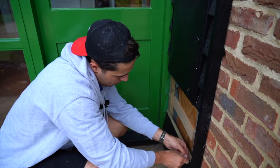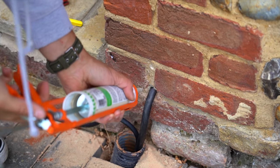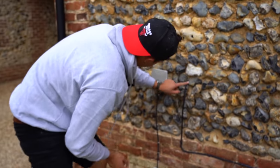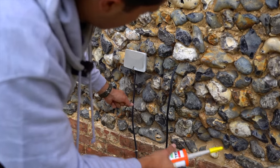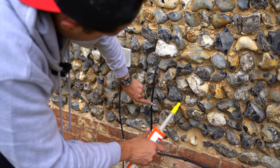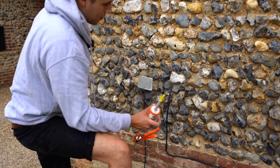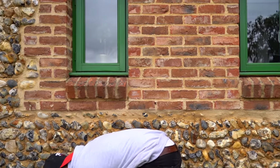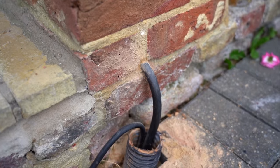I'm just reinstating their house which we've been taking to pieces. Mixing up some mortar, smushing it down into those cracks — a bit more seamless than silicone. I don't think I'm going to put any cleats on this section; they haven't done it there, and I don't really want to permanently mark any of their flint stones. That cable entry is sealed up now — I've managed to get a bit of the dust on there to blend it right in. We'll just seal up that duct as well.